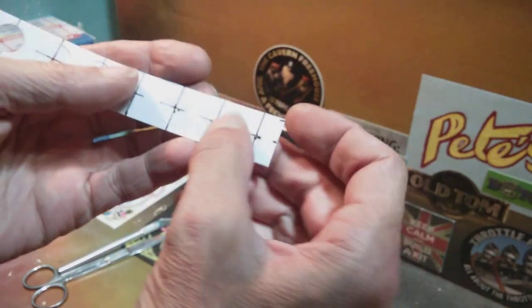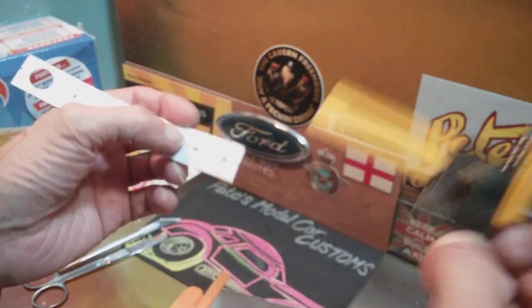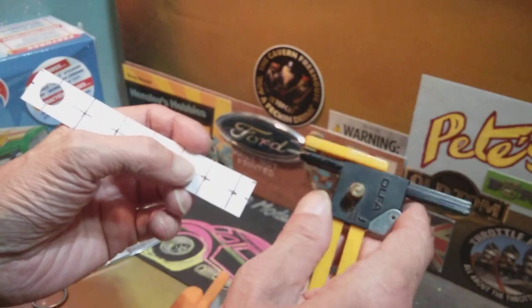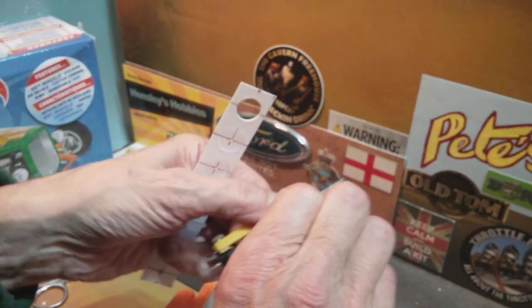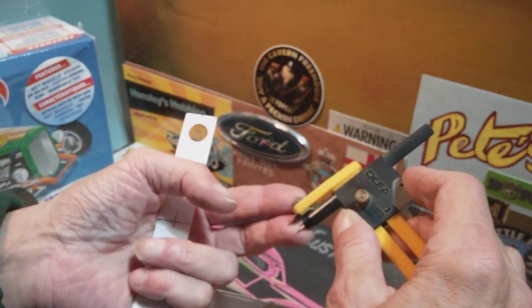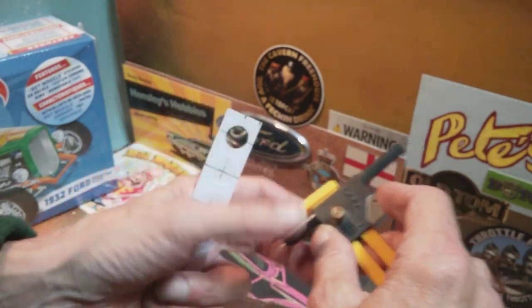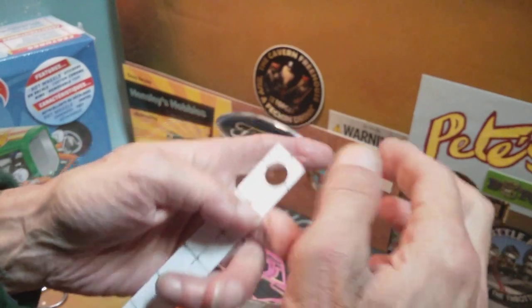And then set this to your outer circumference, outer diameter size. Half of it is the radius to adjust the tool — that point to that point. And that will give you the dot. Times that by two, it gives you the diameter of the circle you're going to cut out.